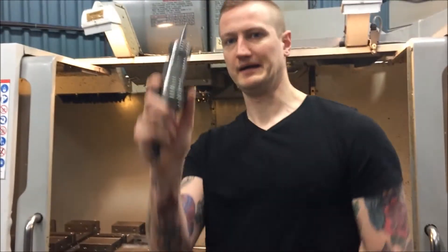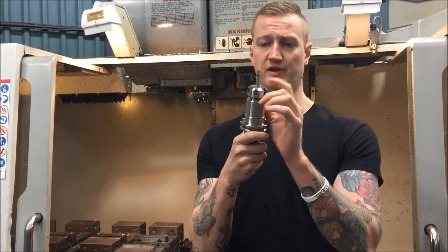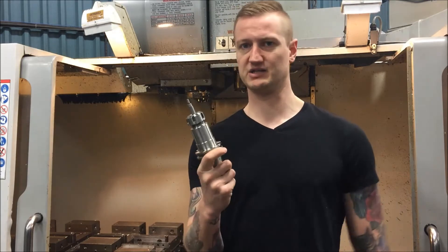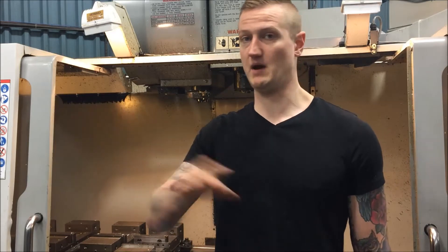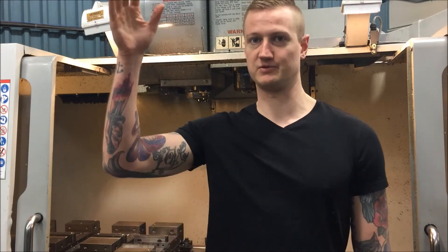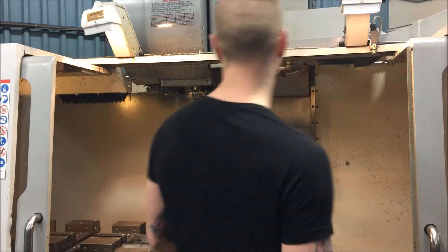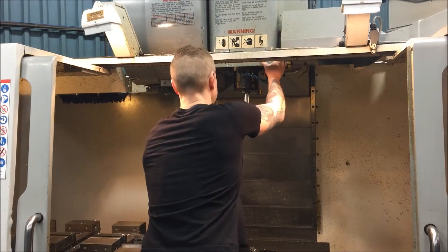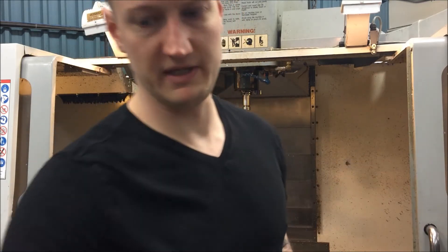Once we have this, I'm going to put it inside the machine. I always put all my tool holders with an edge finder in them in the highest tool number in the carousel — I put them in 25 or 20 — that way if I ever need them, I type in T20 or T25, whatever the top tool number is, it comes out. So go to your MDI screen and pop it in.